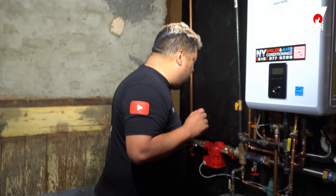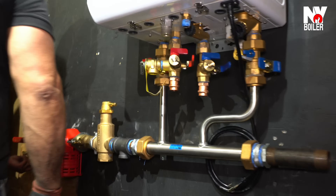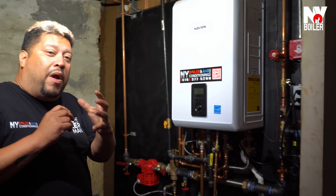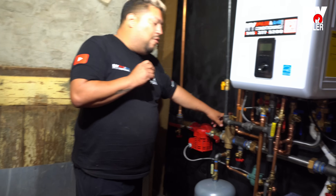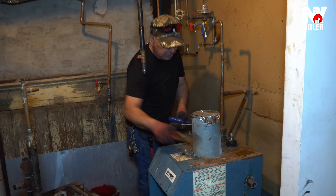We also have the manifold. We have what's called a primary and a secondary loop. Right here is the manifold — your primary loop is here, and over here the heating run is your secondary loop. It's designed that way by the manufacturer's engineer. We also have a purge valve — you'll purge over here. And we can't forget the air separator. The air separator separates air from the water. You still have to bleed the system regardless, but it removes air bubbles because this is a hot water system, not an air system.